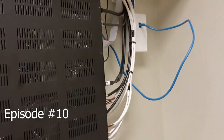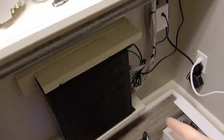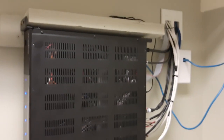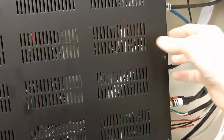What I wanted to talk about: in one of my videos I talked about how I joined two ribbon cables together to make it long enough to connect the two amplifiers. Well, I wanted to say that actually won't work. The reason it won't work is that when the app tries to control it, the app connects to the amplifier with its IP address. What I found out is the app was having a hard time relaying commands to the second amplifier. This cable is used to share audio sources to the slave amp as well as commands to turn zones on or off.